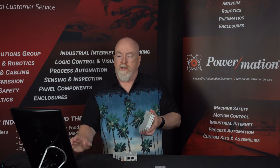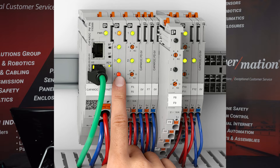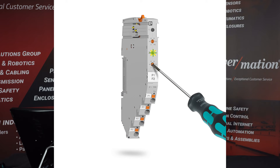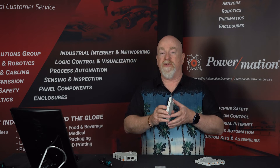Units with the rotary switch are pretty simple to configure — there are amperage indications right on the front. I simply put the screwdriver in and turn to the desired amperage. Once set, I press and hold the green button, which is flashing at this time. Once it stops flashing I release, and now the breaker is locked in at that desired amperage. If you have your load attached, you can rotate the switch and when the indicator goes from yellow to green you know you've reached the amperage required for that load.